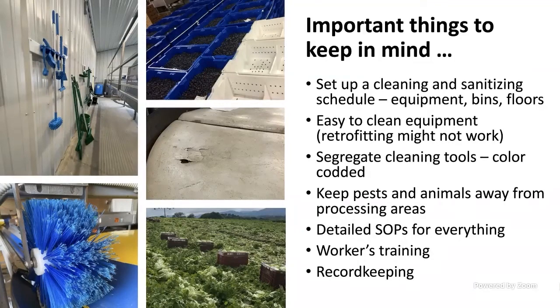An important element of your cleaning and sanitizing program is setting up a cleaning and sanitizing schedule. This can be determined based on your volume of product, time intervals, or between individual lots of product. It needs to make sense for your normal operation. For example, you might do basic cleaning at the end of every lot on your line, or at the end of the day, and floor cleaning every four to five days. Whatever you decide, set it up and follow it.